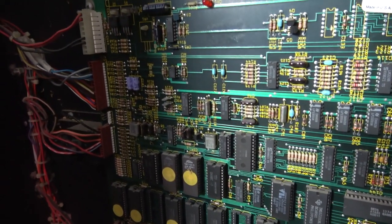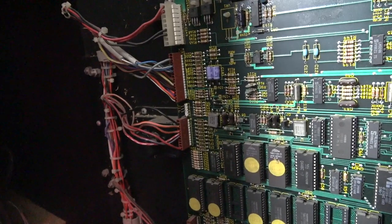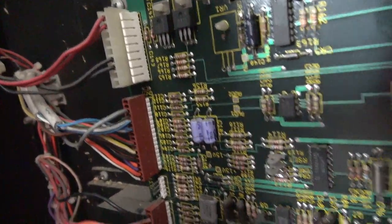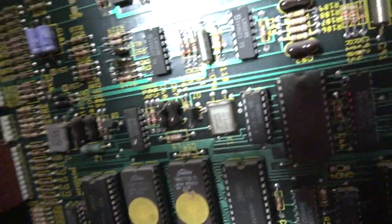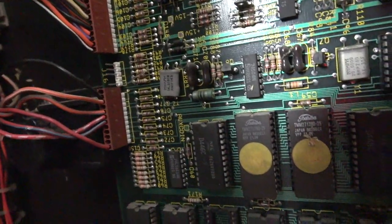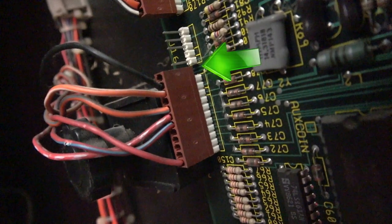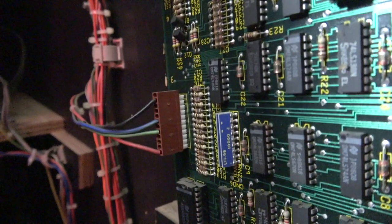I've tested the voltages on the other board and it's getting correct voltages. I've got to be really careful with these header pins — some of them have an extra pin and are offset by one. That's not like the Championship Sprint headers. I'm not sure if these headers were redone at some point with the wrong sizes, so I've got to be careful putting everything back with the right headers.